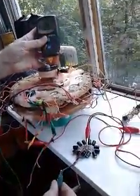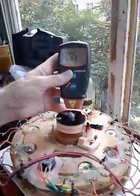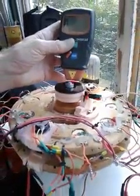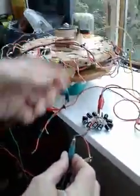It's at 520 RPM right now. Watch how much it dips — 500 right now. It goes down to 461, 400, 461. So that is with the 2640 µF cap.